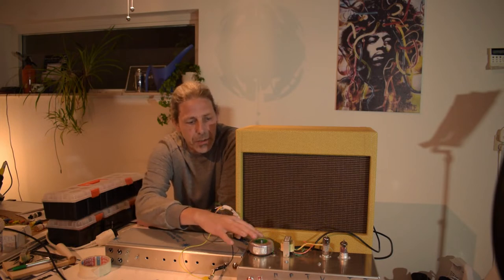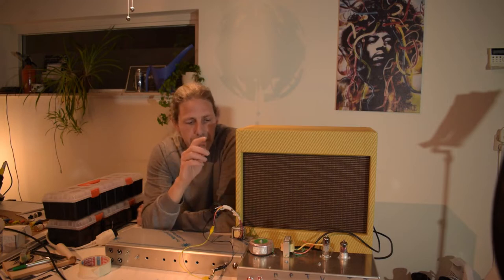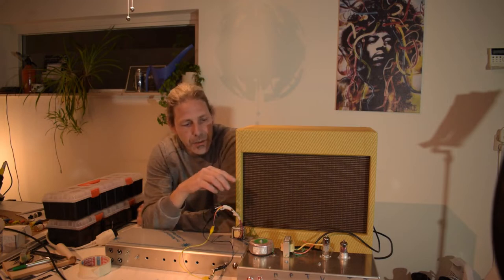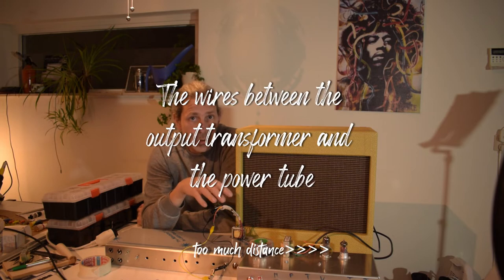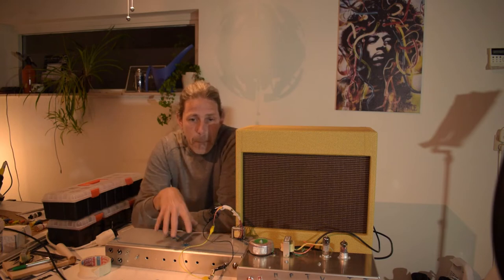and it hums. I wasn't paying attention and my knowledge wasn't up to snuff. So, the hum in the Champ Micro is because of the output transformer cables getting interference. So before I make my Bassman Micro, I want to know how to prevent hum as much as possible.